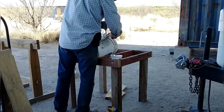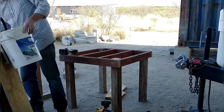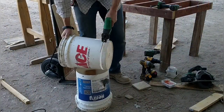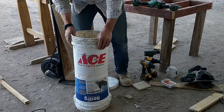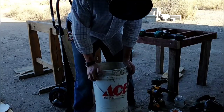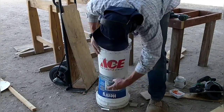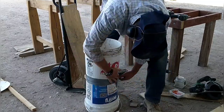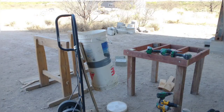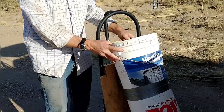I put pieces of wood inside and outside the bucket and screwed them together as a firm mounting point, then added metal brackets that bend over and hook to a bar on the back of the dolly. I cut a hole in the bottom of one bucket, cut the bottom off the other, slid them together to get the angle right, and taped them to secure it. A hyper adobe home uses one continuous long bag going around the circumference — this dolly feeds dirt into that bag and keeps it moving.